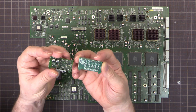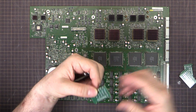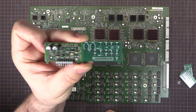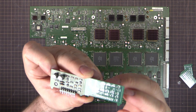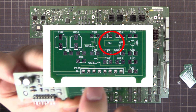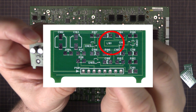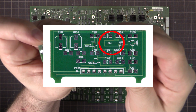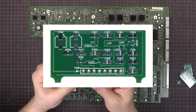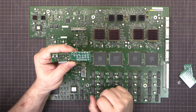So there is our replacement — we've got five of them — and we have basically a perfect one-to-one copy. Now there was one little trick: there's an inductor on this board, but it's not a component — it's a trace looping around. L101. So I had to get the calipers out, get my magnifying glass, hold my tongue in the right position, and measure that up as accurately as possible so I could get that inductor the correct size.